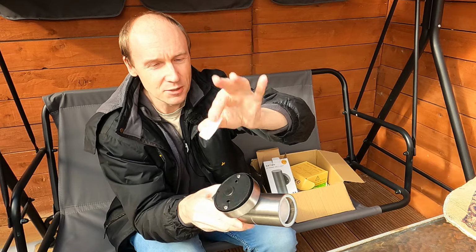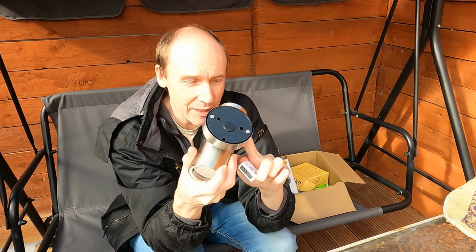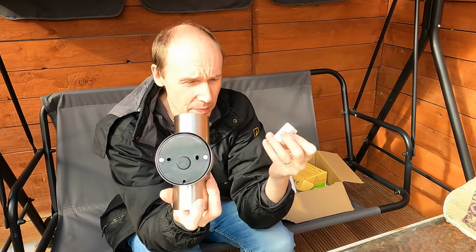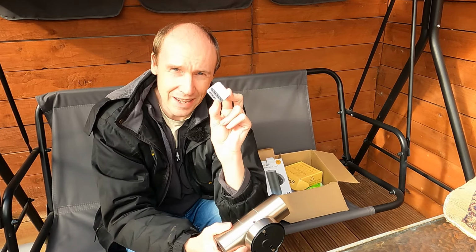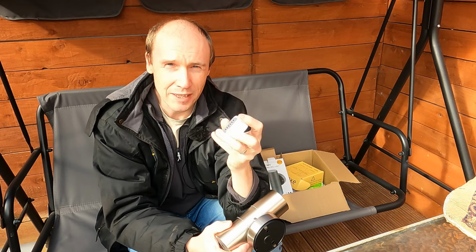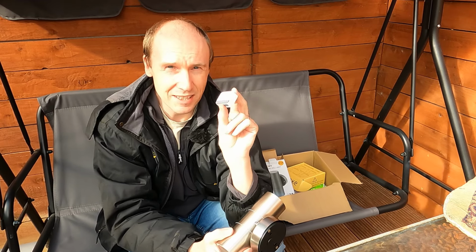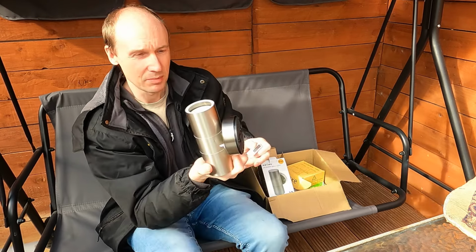but it's not small enough, believe it or not, to fit into the back box of here. I've already tried this, and unfortunately, because of the fixings inside it, it's not going to fit in there. And that's one of the first problems you have with home automation, actually, which is you tend to need extra bits like this. And where do you hide them? Now hopefully this is going to fit in the switch back box, and I'll show you what I mean in a moment. Typically fitting this inside existing sockets or light switches at the back will be our aim.